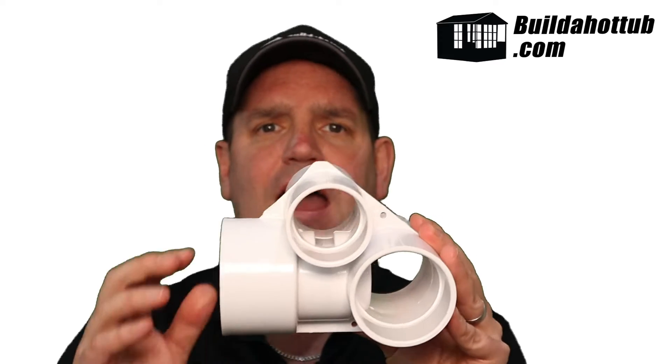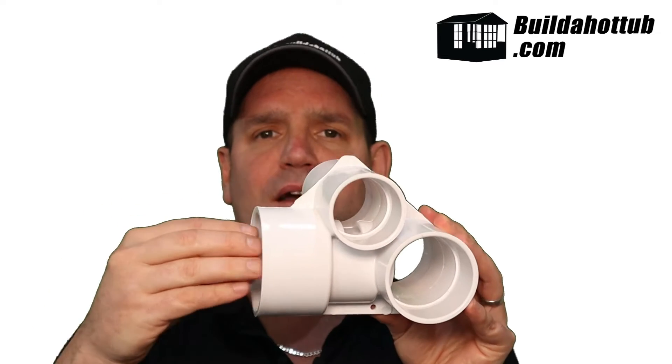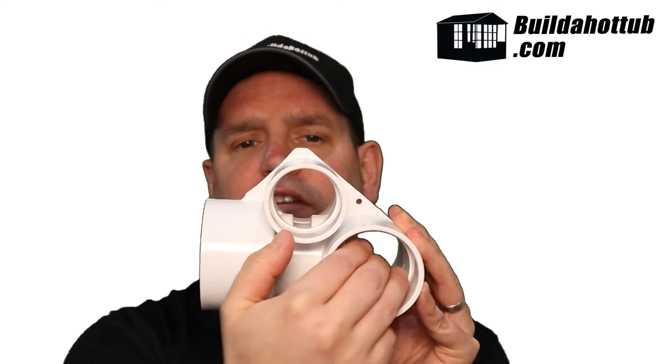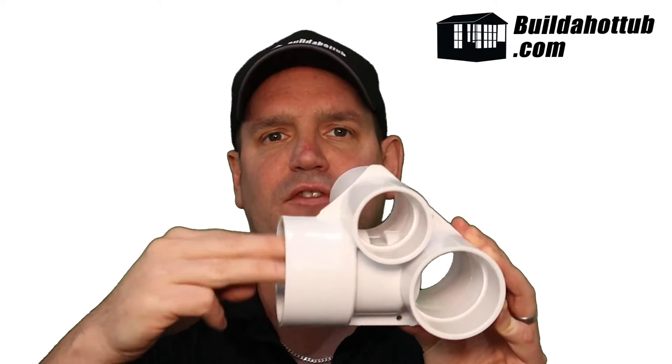Firstly let's talk about a more standard setup of a block or concrete built hot tub using a gunite body, a jet pump and an air blower. So this is a gunite body and it has a one and a half inch air line on the top, it has a two inch water line on the bottom, and we have a two and a half inch pipe which goes through the walls into the tub. The way that it works is the water from the jet pump is sent on the two inch water line. It comes out of the front on a one inch pipe that's inside of the two and a half inch pipe.